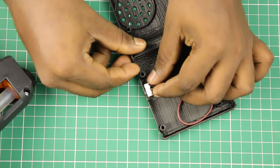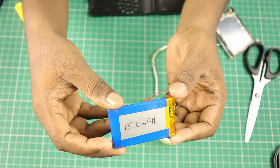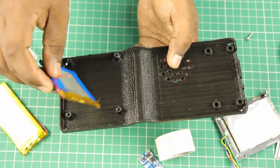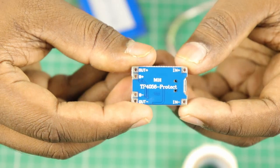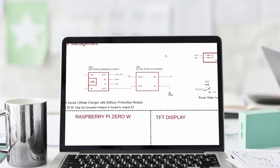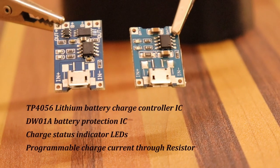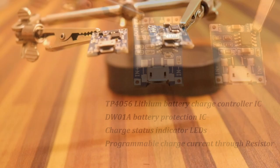We will use a sliding switch for an on/off button. I plan to carry this console along with me whenever I travel, so I need a decent battery backup. I have a 1500 and 2000 mAh lithium polymer battery — the 1500 mAh battery fits properly in its place, so I am going to use this. Since this is a lithium polymer battery, it needs to follow a charging and discharging procedure which can be done by a charge controller module. I am going to use a TP4056 module for this. One version doesn't have any battery protection circuits, while the other has built-in over-discharge, over-current, and short-circuit protection.